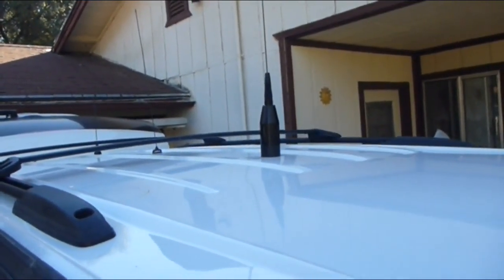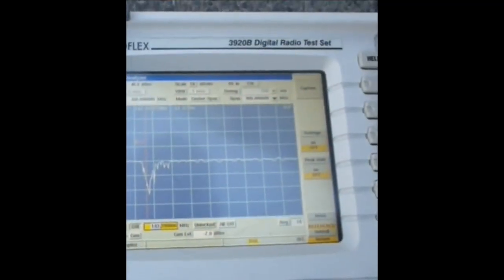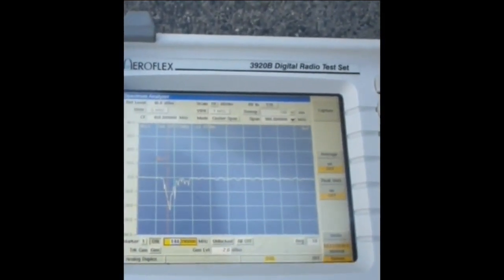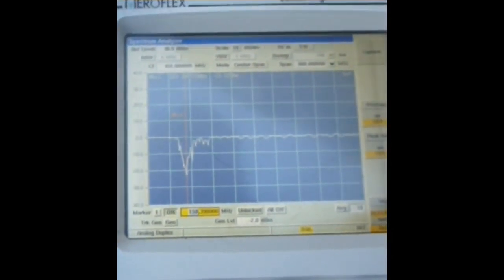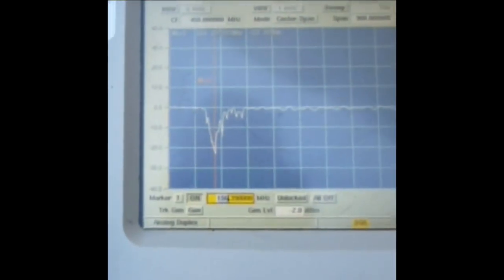The main thing was this little doohickey over here. Let's see how it's working. Right now I got it hooked up to the VHF port here and I'm measuring the antenna with this. There it is — I'm getting 144 MHz at minus 14, exactly 15 dBs of attenuation — return loss. Very good. Going up in the band — doing pretty good in the federal frequencies and some of the other agency frequencies. So I'm tuned in pretty good on VHF there.